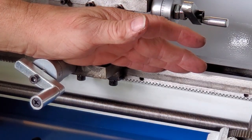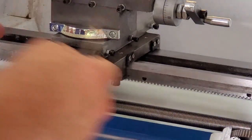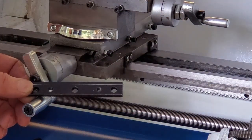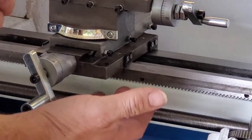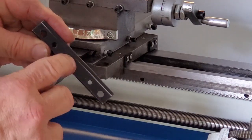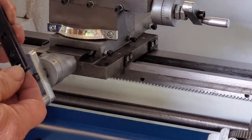We check the bed with just a straight edge — an old metal square, most of you probably have one for woodworking. It looks okay by eye, but the real truth is going to be when we get this so it doesn't wobble and then we'll find out whether the bed is straight in all dimensions. So I took the first one off from underneath — three Allen wrench — and of course there are no grub screws at all in there. As soon as you tighten this down it just locks it up. You can also see it's rubbing here and here and not here, so this plate is not even straight — it's bent as well. We'll probably surface the plates and put the grub screws in and go from there.